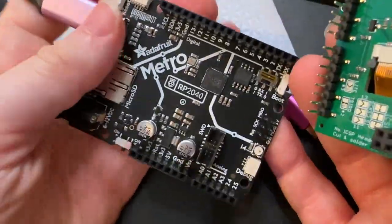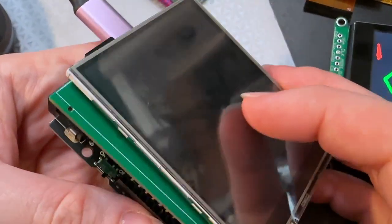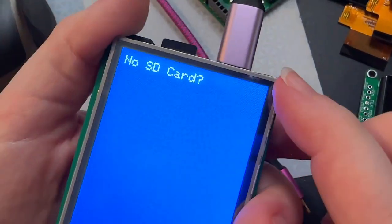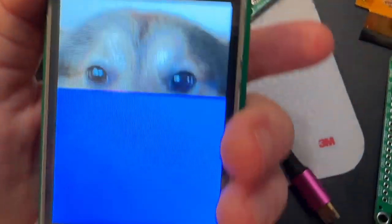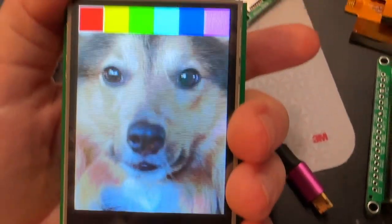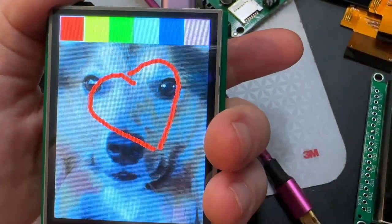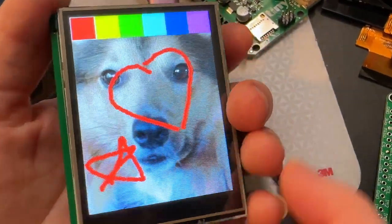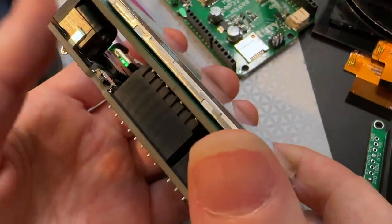In this case I'm actually going to use a Metro RP2040. We just put these in the shop and they're very low cost, and the UF2 bootloader is built in so they're a lot more reliable. It's running a little code that's looking for an SD card, and when I insert the SD card it looks for an image called 'woof', and then I can test the touchscreen. This is a great way to give the test prep folks at Adafruit a quick way to test all the functionality for this shield so we can get it into the shop very quickly.